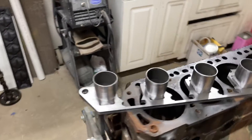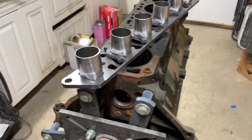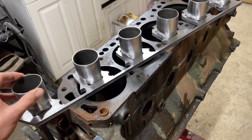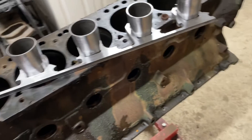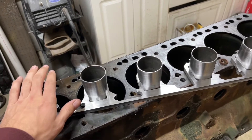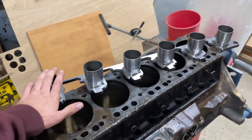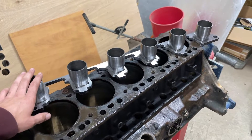I got an exciting piece of information — I officially got my header flange from Stainless Headers. It is mild steel; I'm not really set up to weld stainless and I'm not set up to back purge either, so I'm going with mild steel. Two inch is what I went with for the tubes, and then in the middle before it goes into a collector it's going to be two and a half inch. Everything before the turbo was two and a half inch as it is now. There's a turbo header for the 300 on their website for about a thousand to eleven hundred dollars, so I'm going to be making my own.